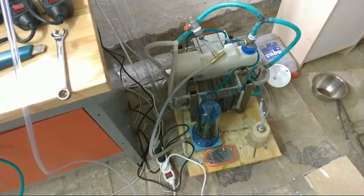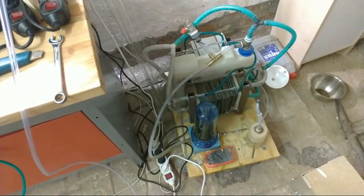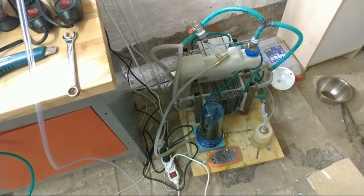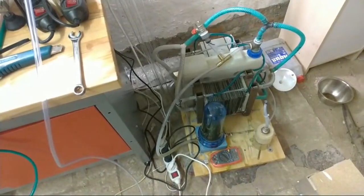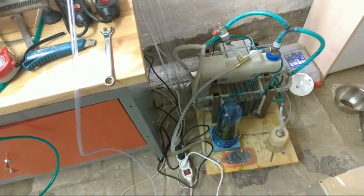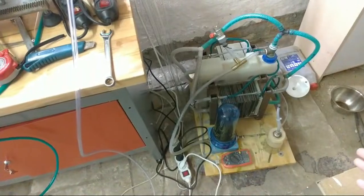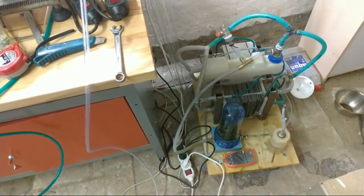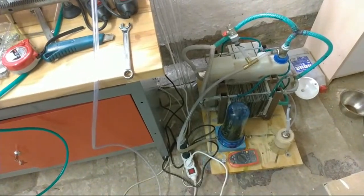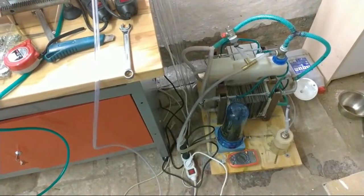Basically, I used 1 millimeter stainless steel plates. That's ridiculous. I should use maybe 0.15 millimeter stainless steel plates, because you could cut them then with scissors. You don't really have to pay somebody to cut them with hydraulic scissors. I cut these with hydraulic scissors. They are sharp as hell, and it was a pain in the ass to drill holes into them, and yeah, this is really bad.